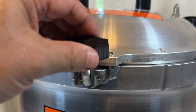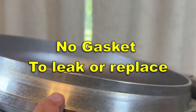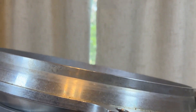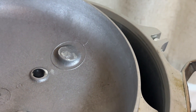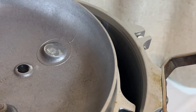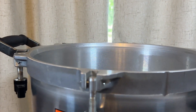I want to talk about how well this thing is made. Obviously, this is how you tighten it down, how you seal it up. There's no gasket here. That beveled edge right there is machined so well that it mates with this beveled edge right here. They mate together, and there's no gasket necessary. I was in manufacturing for 40-something years, and the tolerances they are achieving to make this thing seal with no gaskets is just amazing. I can't express how well-made this thing is.